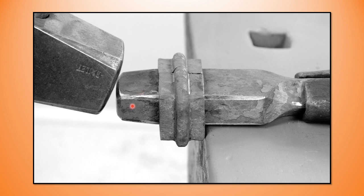The important thing for me when I have a mandrel is that the mandrel has a taper to the end. The taper is as long as the collar material is wide. And of course, when that taper is resting underneath, the collar will just fall off the end of the mandrel. If you don't have a taper, when you're trying to shed the collar from the mandrel, you're going to have to go hunting around the workshop for something to knock on the end to knock the collar off.